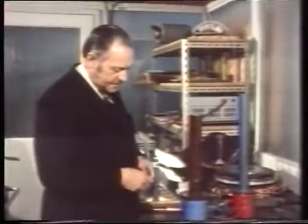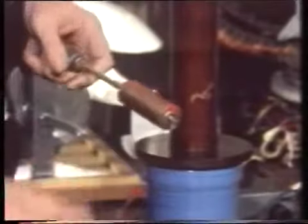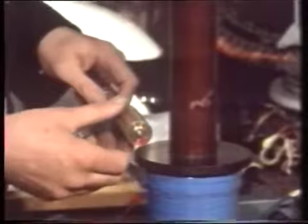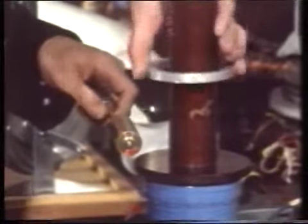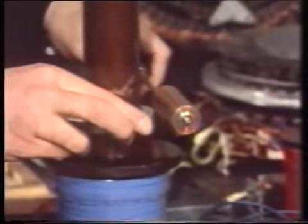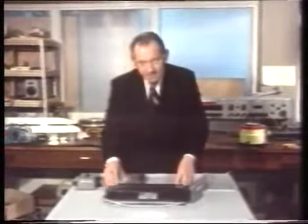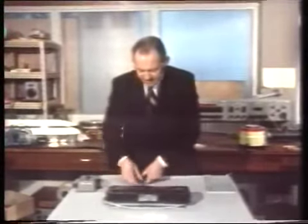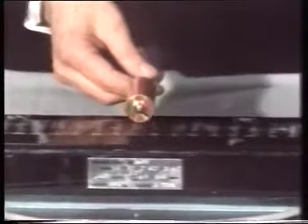Now what is the secret of this amazing device? This is the giveaway — a copper cylinder that is free to spin. If I hold the copper cylinder alongside, there's nothing much going on. But if I take this ring which wants to float up there and I force it down alongside the copper, then the copper begins to spin. And if I put it on the other side it spins the other way. It is as if there was an upward sweeping something which is causing the copper to spin, and we call that upward sweeping something a travelling magnetic field. Now this is a row of electromagnets arranged deliberately to produce one of these travelling magnetic fields. When I switch it on and put our copper cylinder over it, you see the same effect as if something was sweeping underneath it.